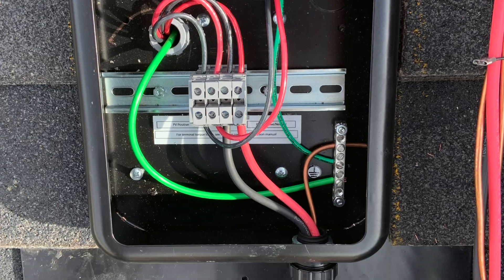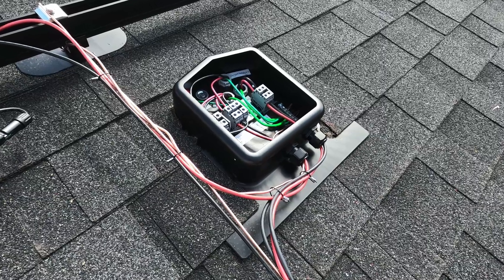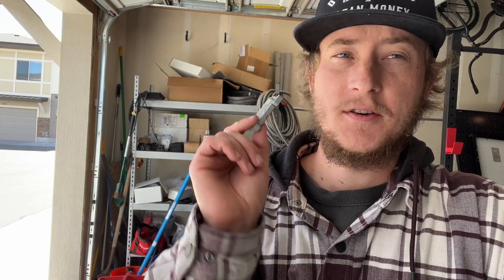They do say that if you have connectors that aren't compression-type like a Wago, and they are screwed down, you actually need to tighten those for regular maintenance — which is interesting. Terminal blocks look really good and are great for testing; you have everything in a row labeled and can test different conductors. It's really clean, but I see these fail all the time because they're installed wrong.